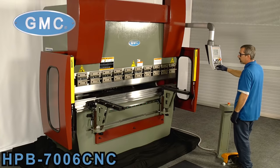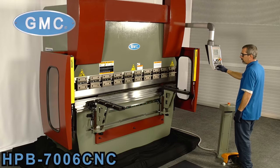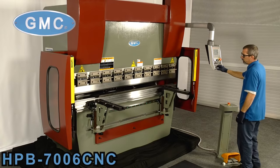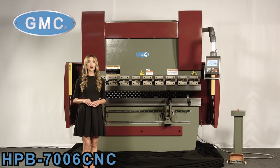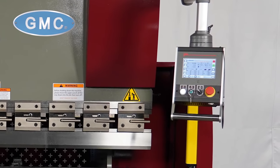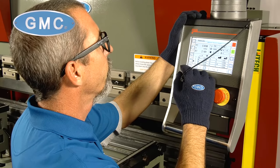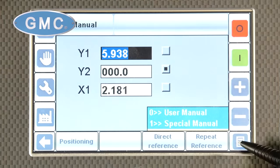With its rugged steel framework and quality hydraulic and electronic components, this press brake makes a great addition to any shop. The ESA 625 offers a vast tooling library. On-screen and offline software programming allows for thousands of tooling programs to be saved. On-the-fly program corrections will save precious production time. The touchscreen control can store thousands of production programs with up to 80 steps per program.